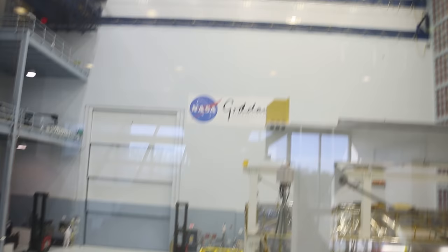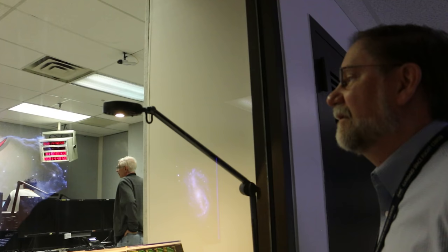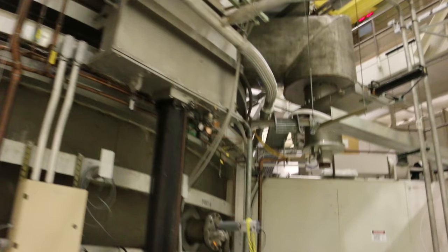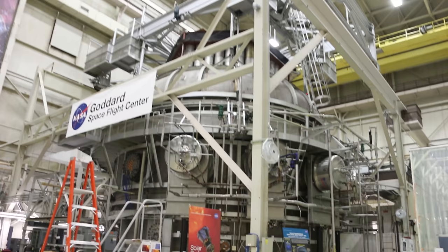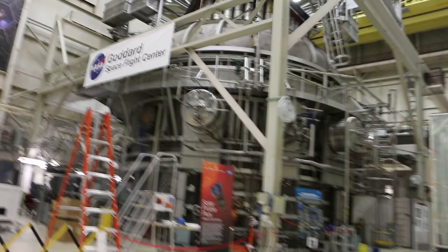This interview took place at NASA's Goddard Space Flight Center in Greenbelt, Maryland, where they've been controlling the Hubble Space Telescope for several decades. When you're building a space telescope, you don't want the first time it sees a vacuum or near absolute zero on the sensor side to happen in space — you have to simulate that on Earth. The answer is a huge thermal vacuum chamber built at Goddard back in the 1960s. They pump liquid nitrogen into it to make it cold and simulate the environment of space. That's how you simulate space on the ground.